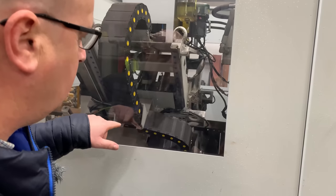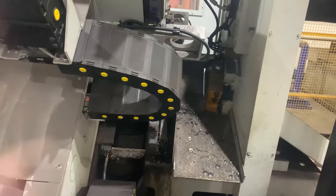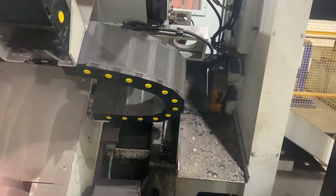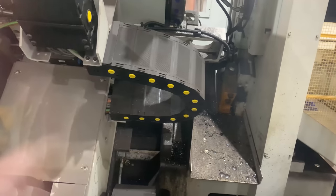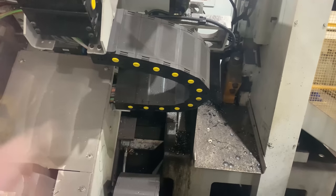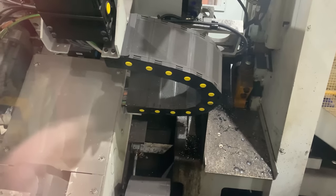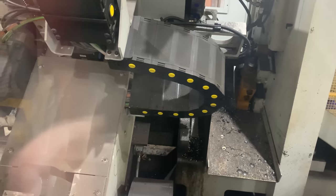Your angle iron machine takes in the angle iron and does its drills — it has two drills, one at both sides — and whether it is milling or drilling, it's working from each side at the same time. It comes through then, and here at the front there's a guillotine-type system that cuts the angle iron at whatever length and whatever angle it requires to be cut.